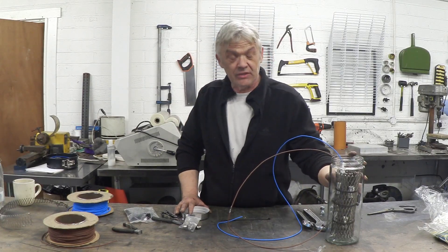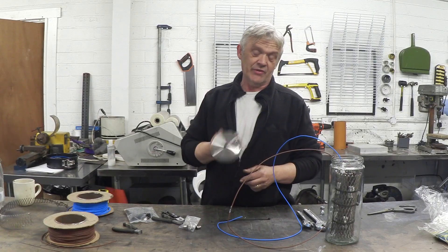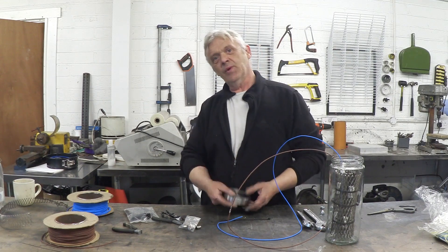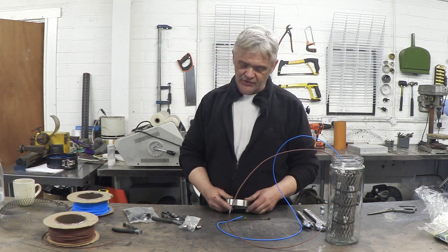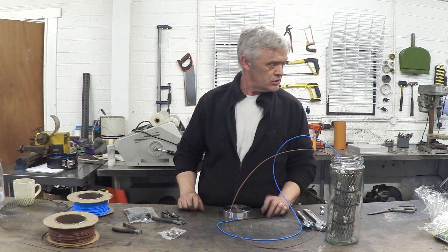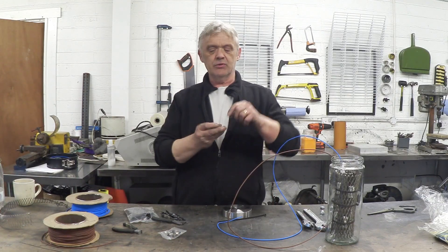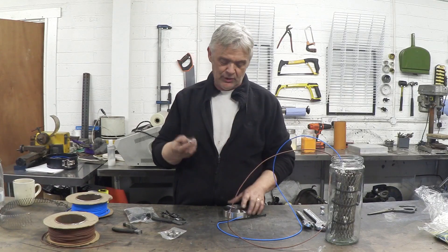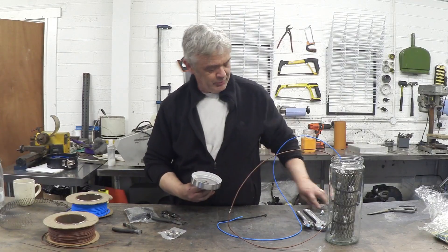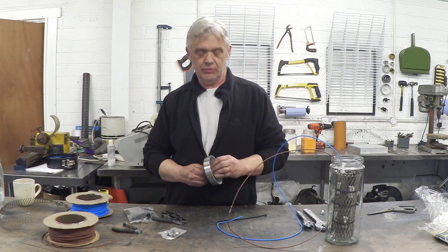It's pretty much ready to go. The reason you would do this is obviously to collect the hydrogen gas it's going to generate. The jar came with a lid that has a little seal around it, but I might put extra sealant on there. To collect the hydrogen, we need some way of getting it out — this is a specialist valve seal that takes a blue tube and forms a gas seal. All I have to do is drill some holes in the lid, pop the valve in, and bolt it on. Put a bit of PTFE tape or sealant around that, then I'm ready to stick the blue tube in to carry the hydrogen away.